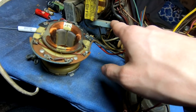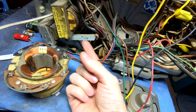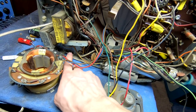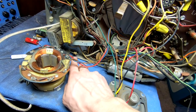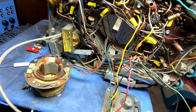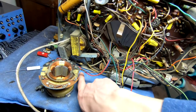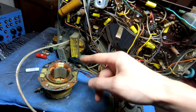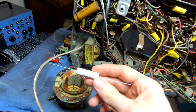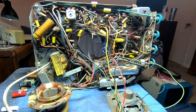I realized a little while ago, looking at this diode right here, this is not the original diode, obviously, and this power resistor, this 20-watt guy right here, is also non-original. Someone's already beaten me to the punch and replaced the original selenium rectifier, so I don't have to worry about that. I checked the output voltage on this, and it is exactly what the schematic refers to, about 134 volts DC at the first electrolytic here. So that's good. We're going to leave that alone. Everything in there seems to be done pretty well. It's protected, so great. Also, here is our replacement for that. Good size. And I have a box elsewhere with all of the replacement electrolytics.